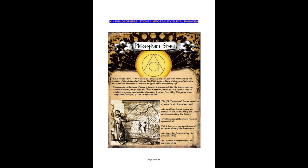1. Oxygen availability. The rate of corrosion will be limited by the amount of oxygen that can dissolve in the water and diffuse to the copper surface. 2. Surface area. The rate of corrosion depends on the surface area of the copper exposed to the solution. We don't know the shape of the ingot, so let's assume it's roughly cubical.